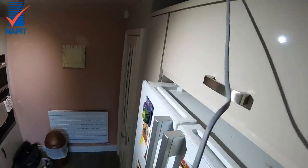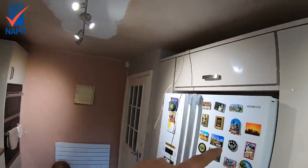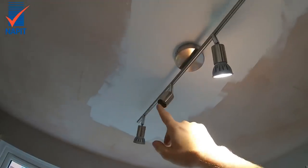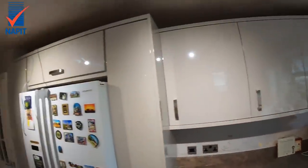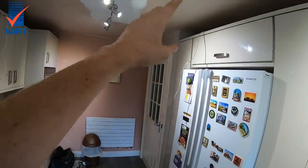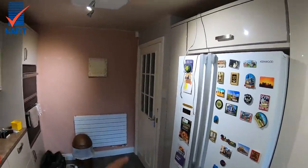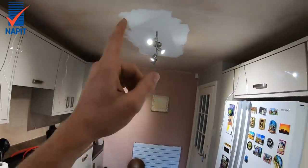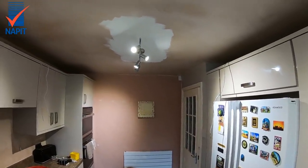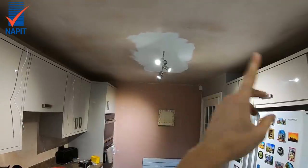I've taped up the cable end even though it's not connected to supply. With the under-cupboard lights, the two pre-existing lights - customer didn't want downlights, so these are fitted brand new but one doesn't work. What we've done is tapped off a live feed there, taking the switch down. I managed to feed the cable down through a really nice void - the ceiling had holes everywhere because it's laminate floor upstairs so I can't take that down. So live feed taken there, switch drop down, and then the switch cable was jointed off and spread across to both sides.